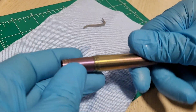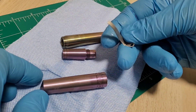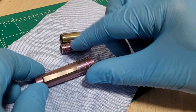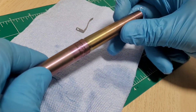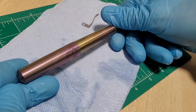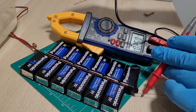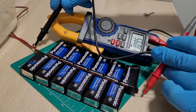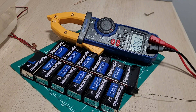Moving everything out of the way to assemble and see the result. The inner non-titanium parts are removed. The clip didn't anodize — it may not be titanium — but I think it'll actually look good anyway. Putting it together to see the finished result. We're getting a cool gradient look across the pen. Checking with a meter: we're getting around 109 volts, but it's dropping off quickly.